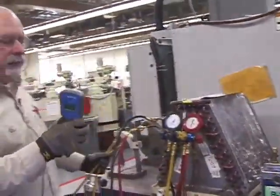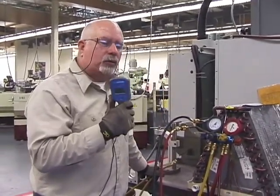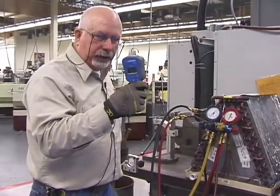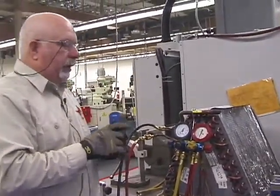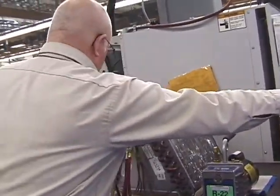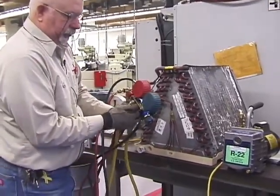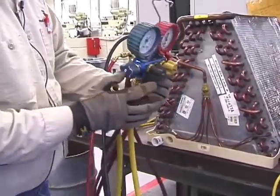Because I have to put my gauge into my system. Now, here's where it gets a little complicated, and you just got to stop and think. If you're using the 3-way gauge, and you're using this, you got to have another hose. If you're using the 4-way gauges, remember that I talked about that 3/8-inch hose in the back, the large one. This is going to speed up my process. But I want to show you a little trick here.